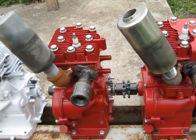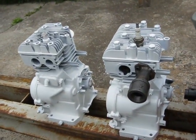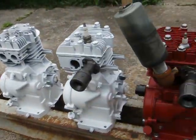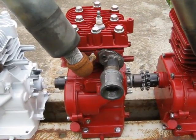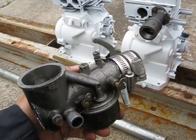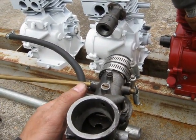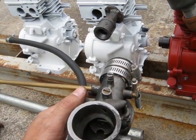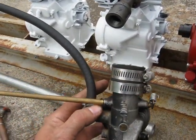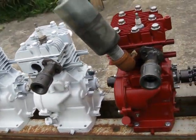I'm trying to figure out the intake manifold on this straight eight. I'm grouping them together in two gangs of four cylinders, just because of the physical length — it's way too long for one log-type intake manifold. So I'm going to go with the same two carburetors I used on the four cylinder. I was looking at 805 Road King's four cylinder — he's got a pretty small carburetor feeding his little five cubic inch four cylinders.